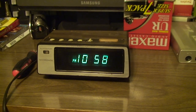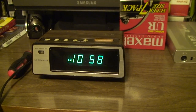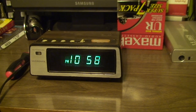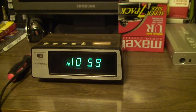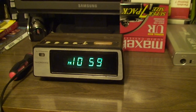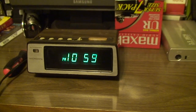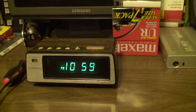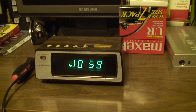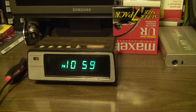In closing, there are a couple of other interesting functions and interesting behaviors in this clock's programming or logic. Most alarm clocks will only go off when they turn over the next minute that happens to match the programmed alarm time. This one is different — as long as the minute value is exactly correct, this thing will sound the alarm the moment the alarm switch is slid on. So clearly, it performs a comparison against the current time versus the alarm time, and not just when the minute simply rolls over to the appropriate prescribed hours and minutes value.